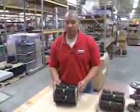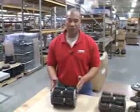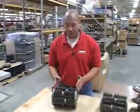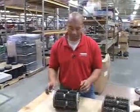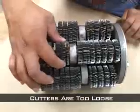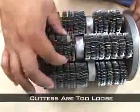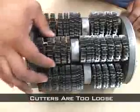This is the pointed steel cutters in a broom-like finish setup. Edco offers a guide to show you how to properly load the cutters and spacers on the CPM8 drum. However, it is just a guide. As you can see in these setups here, there's too much movement. This is caused by the varying thickness of the spacers and the pointed steel cutters.